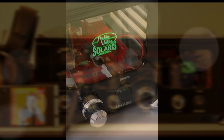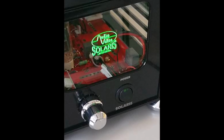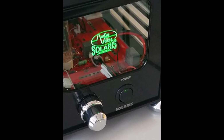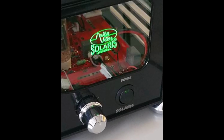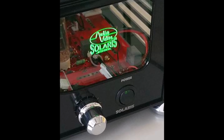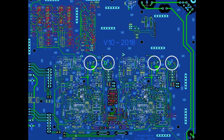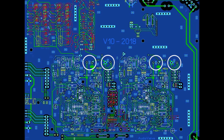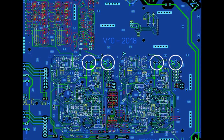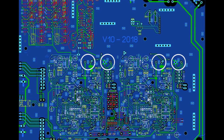After an operational amplifier to control the LF signal, the first tube amplifies the signal as a triode. The second ECL85 provides the phase inversion for the two series connected power tubes in the pentode mode. In between, the signal for the Prestige output is tapped via Elko and provided to the XLR sockets after a voltage divider. The transformer used, for the corresponding output variance, is a so-called autotransformer, a transformer with only one coil without galvanic isolation. AudioValve developer Helmut Becker has opted for a model of the German manufacturer Pikatron from the Taunus.